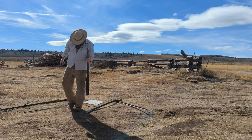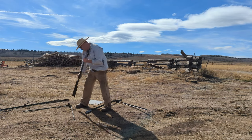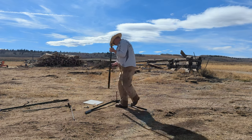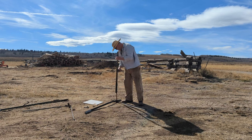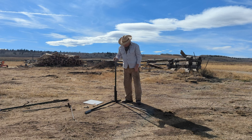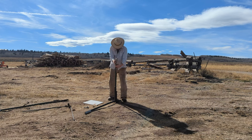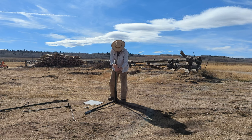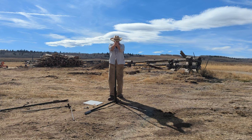Here I'm demonstrating how to put it on a t-post — whether it's the t-post you weld onto or the one you drive into the ground. And here I'm demonstrating the smaller pipe sliding right onto the form stake, which is my preference. Something to think about: your pipe will spin on the form stake. If that's an issue, drill a hole in the pipe, weld a nut to the outside, and thread a screw through so you can tighten it to the form stake. That'll keep it nice and straight toward the shooting location, which is really important.